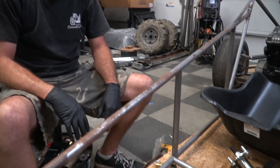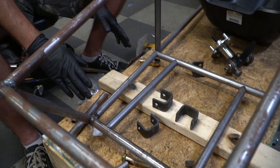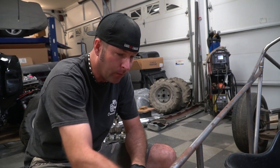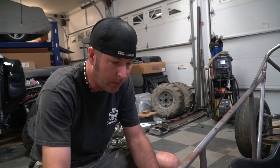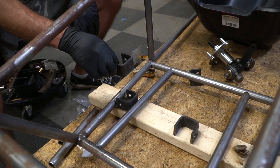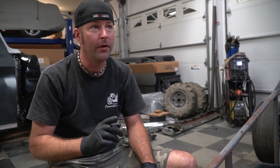There's a little bit of a redesign on the front end of this cart. It's gonna be a little harder to mount suspension points at angles — I like to go straight with it. So we've made some other bars that we're gonna weld in and eliminate the two outer bars, which will allow us to put these pivot points for our front suspension in place straight rather than at an angle. The biggest deal is we're trying to eliminate bump steer, so we're building the frame to match up with the steering rack.